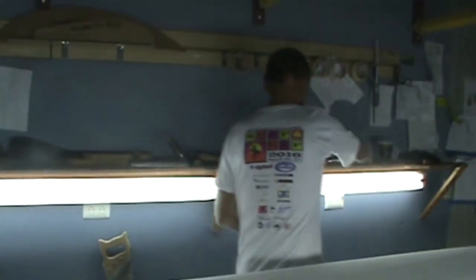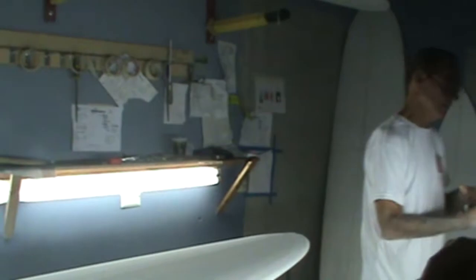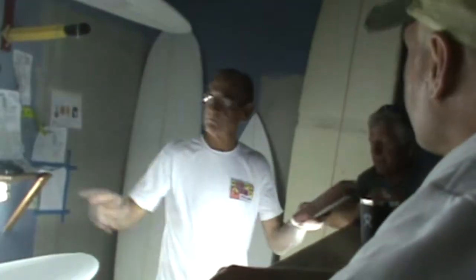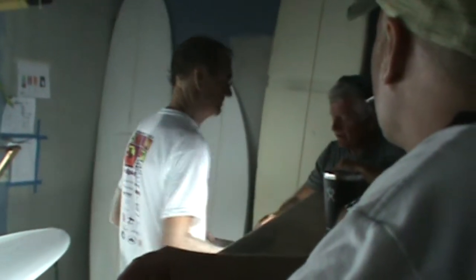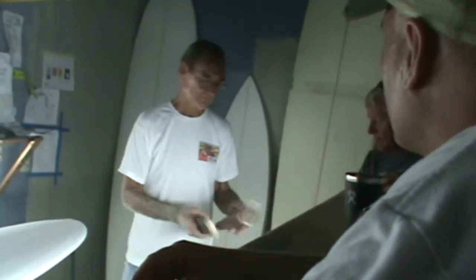I use a lot of different grades of sandpaper. So, you can feel it. So pretty much I made some scratches and stuff with that Surform, taking these out. And then, when I get down towards the end, I'm gonna smooth out the scratches I made with that fine sandpaper. What's your final grit? This is like an old piece of 80, I'll say 80 or something, yeah, and this is like 40.